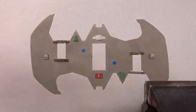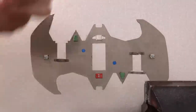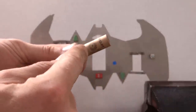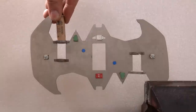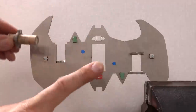I screwed up on the motor mounts — I filed this one too much and it's not a pressure fit. The part I screwed up on was that I measured the middle of the rocket motor, not the ends, and the ends are actually slightly larger than the middle. So my sizes were wrong on my engine mount rings, and I had to grind them out substantially to get these to fit. They're snug, which is what they're supposed to be. The next step is to weld them on.